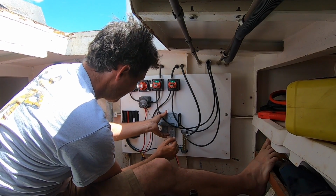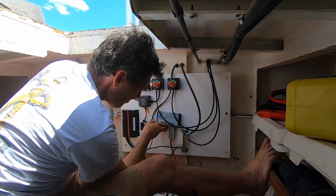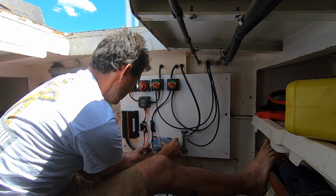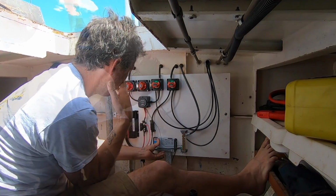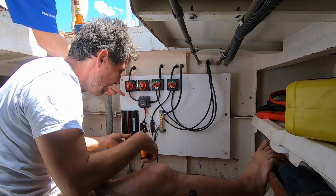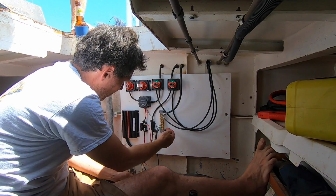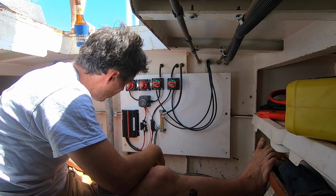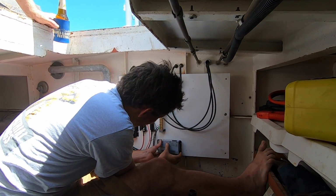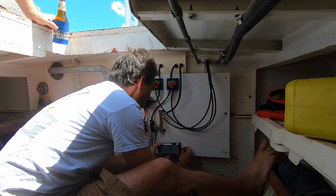With the negative bus bar where it is, does the inverter still fit? Possibly not, which means maybe we could drop that controller across and then put the bus bar above it. Because the other thing is, you're putting negative and positive in close proximity. There is that, but we could always just go into this side. Swap them over, there's heaps of them. Alright, so we'll swap those to that side. And oh look, there's even an old hole here, we can use that one. Then just see how it all stacks up.